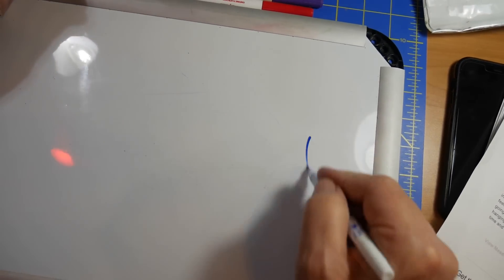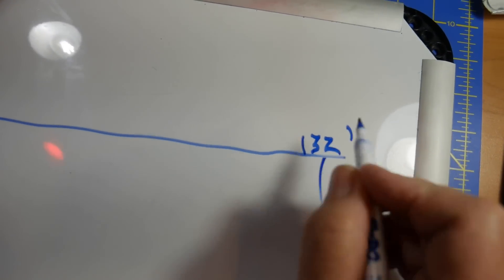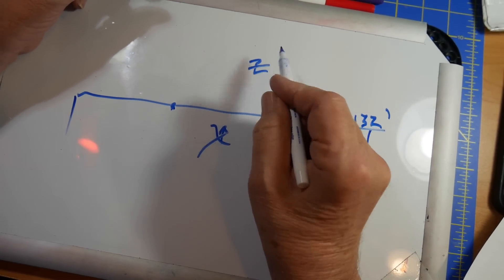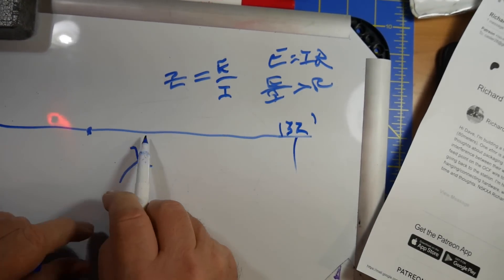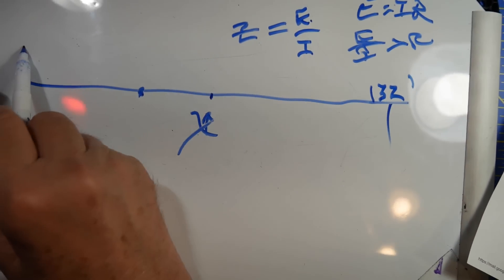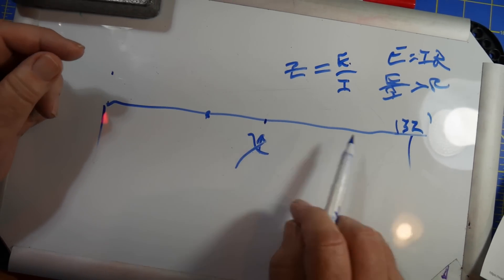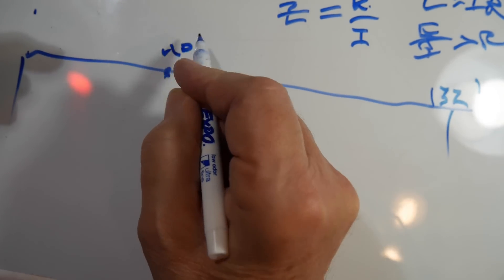So he's got a wire that goes this length here, and this is for 80 meters, so it's about 132 feet long. He's not going to feed it at the center — he's going to feed it at about the one-third point. The impedance, remember, is just the ratio of voltage divided by current. The minimum impedance is at the center. As you move out, the voltage begins to rise until it's quite high at the ends, and the current goes down as it gets to the ends. That's a rough approximation, because if the thing is radiating 100%, the current and voltage must be in phase. So there's a lot going on in an antenna. The input impedance at that feed point is about 400 ohms.